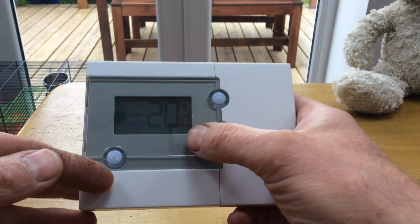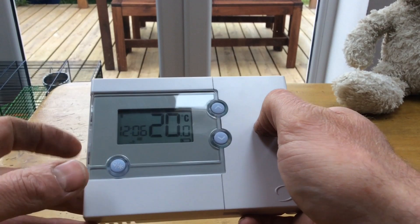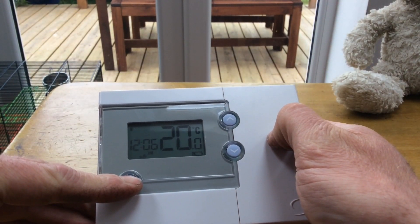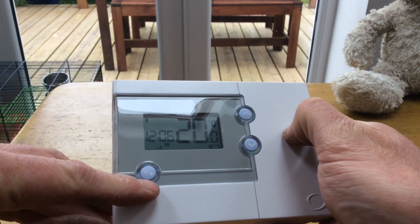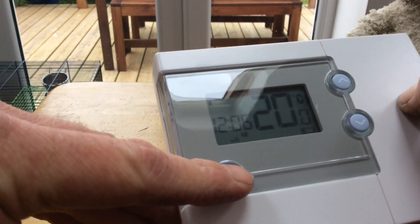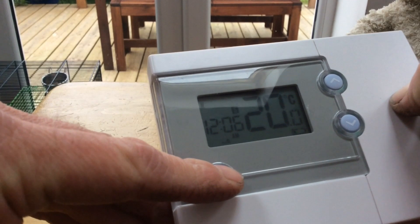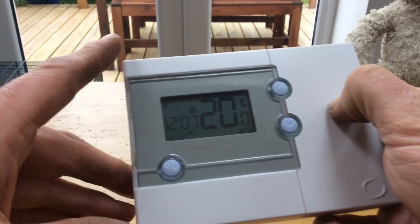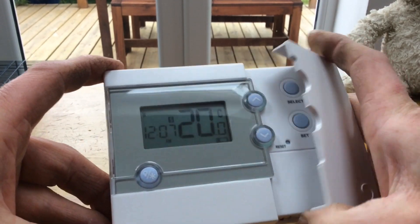There is also a battery level indicator that tells you how much juice you've got left in the battery. You can see the frost flashing in the bottom right corner — a little frost sign. Nine times out of ten if I get a call-out to say the heating is not working — normally on a Sunday evening — it's because they've accidentally pressed that button and put it into frost mode.